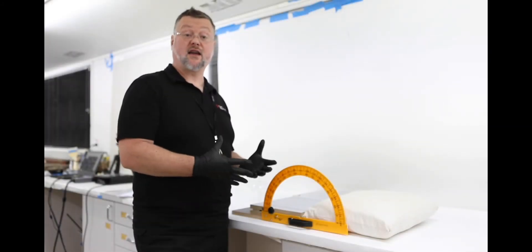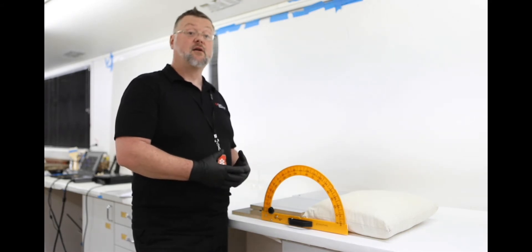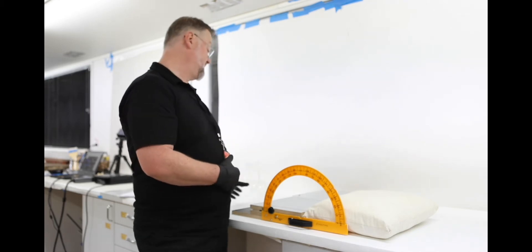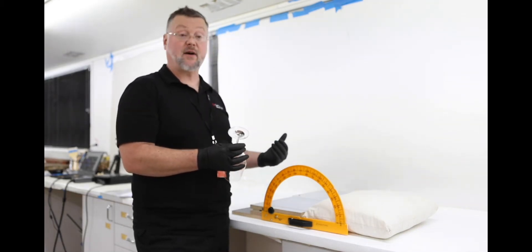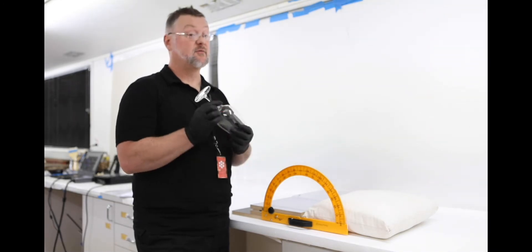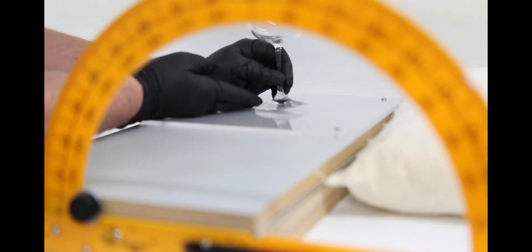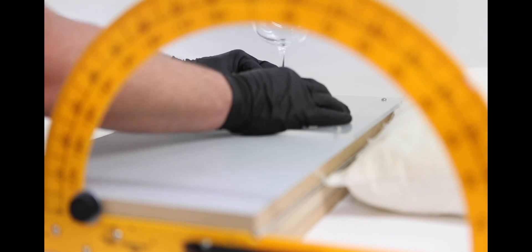So how do we know that LASCAL will be suitable for object restraint in an earthquake environment? One of the tests we do, which is very simple, is a tilt table test. We take our object, we attach it to a table, and we lift it up until the object falls off. Preferably use a stunt object. When placing your object onto display, locate it where you want it, press it down, and give it a gentle twist to lock the adhesive down.